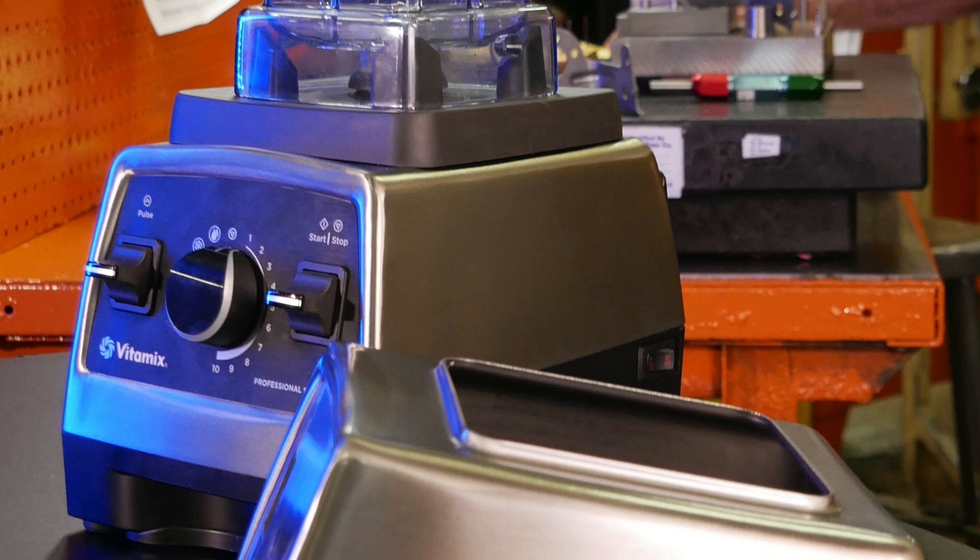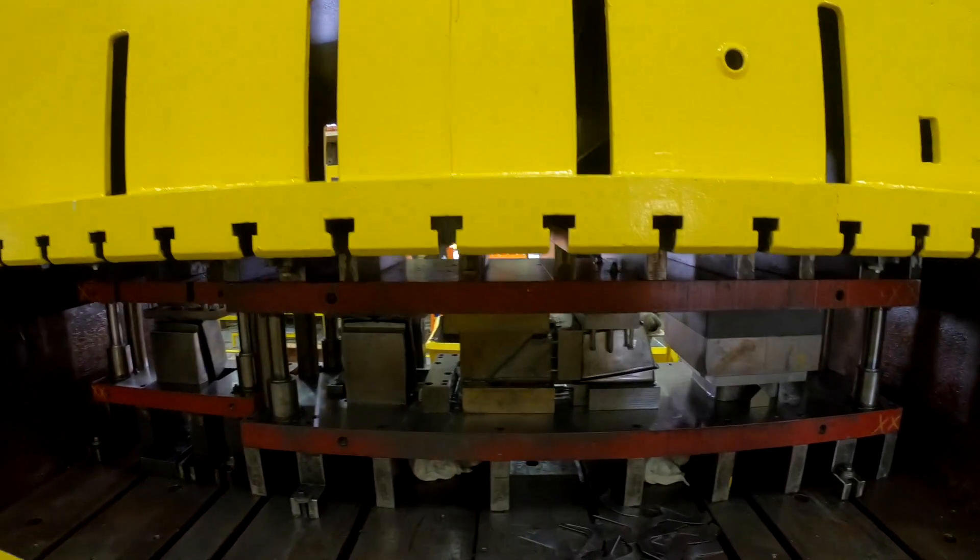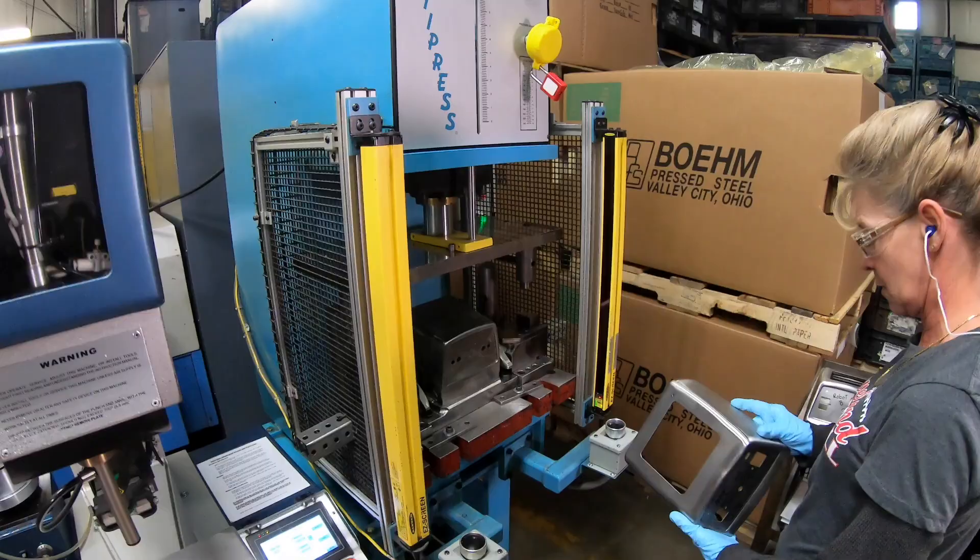Now to get stainless steel — that's too deep a draw to do in stainless steel — so we had to come up with a way to get around that. We were able to come up with a process to give a brushed stainless look to our part that normally would have had to be achieved by actually using brushed stainless, which would have been cost prohibitive. But we came up with the process to take cold rolled steel and form it to about 85 or 90 percent of the features that can be put into it with forming and pressing.